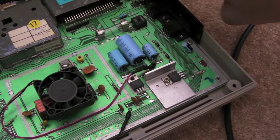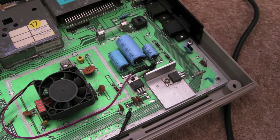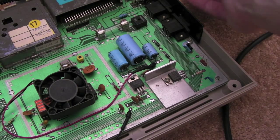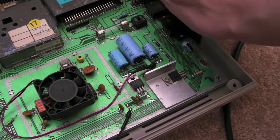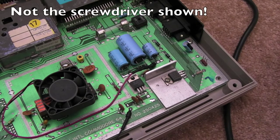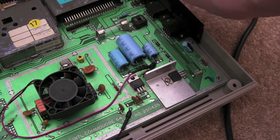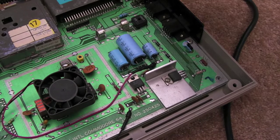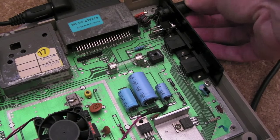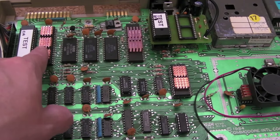So I followed his advice. One of his videos he took this switch to bits and cleaned it all up. All I did at first was spray a bit of WD-40. I cleaned up the connector there, cleaned up the pins and bent them slightly, because it still slots in really easily — this socket's a bit worn. I used a really fine jeweler's screwdriver, small enough to get into the pins without widening the holes. They're encapsulated within the plastic. I cleaned it up, sprayed a bit of WD-40, measured the voltage, and we jumped from 4.6 volts on the VCC to about 4.7. That made a little bit of difference, not a lot.